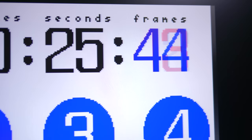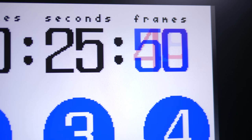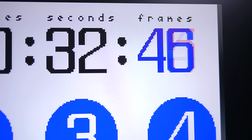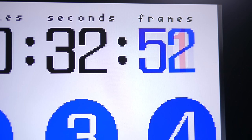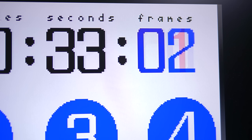With a device like this, lag isn't the only potential issue. We'll want to double check their claims that this does not compress any colors and does not drop any frames. Here's my camera set to 4K60, aimed at the RetroTINK 5X plugged directly into my PC monitor. If we slow it down, you can see every frame is being recorded as the counter is showing every number. And now here's the 4K Gamer Pro at its highest setting, also showing every frame. Since no numbers are being skipped, that's pretty good proof it's not dropping any frames at all.